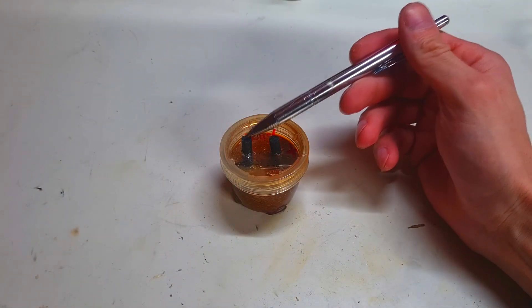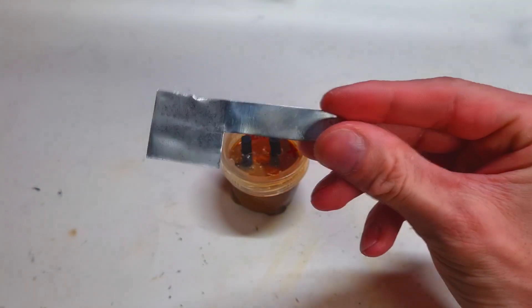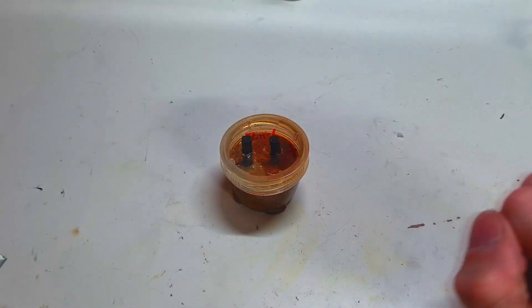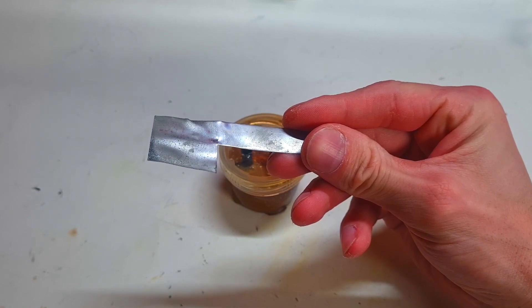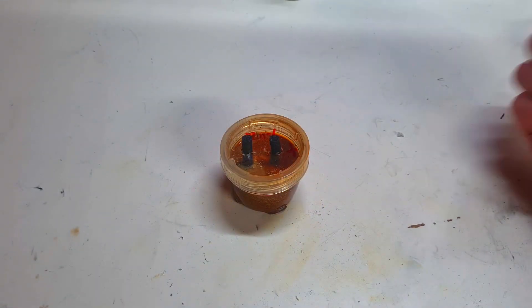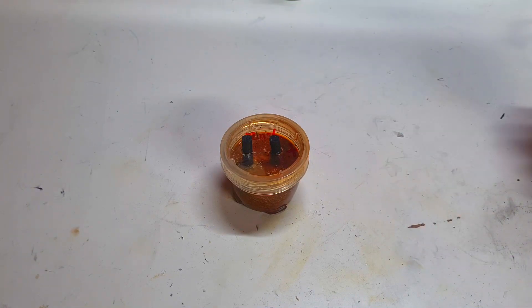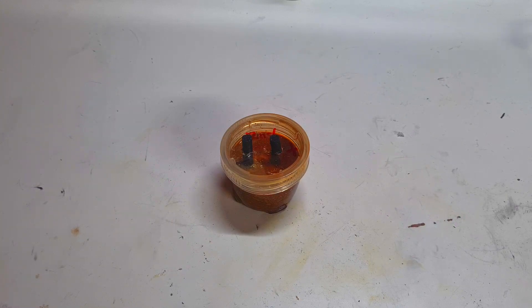In this cell I still use the carbon rod for the negative electrode. You can replace it with zinc, but if you use zinc for the negative electrode it can corrode. This is bad because the zinc acts as both the negative active material and the negative current collector at once. If the zinc corrodes, you can lose contact. For this reason, it's better to use a carbon rod for the negative electrode, as it creates a stable contact and won't corrode. During charging, zinc goes from the electrolyte onto the carbon rod negative current collector, and during discharging, the zinc formed on the carbon rod dissolves back into the electrolyte.